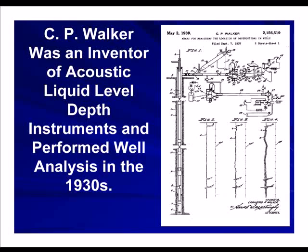You could release some gas into the well or shoot a blank shell off. Hydrocarbon gas will not explode unless you put oxygen with it, so as long as you have a sealed system up here and the pressure is greater than atmospheric pressure, it won't explode. So you can shoot a shell in there and it's no problem. That pulse goes down the well and reflects back off any change in area — if it sees a tubing collar, a casing leak, a liner, a tubing anchor, any of this stuff down hole, it'll show up on your chart.